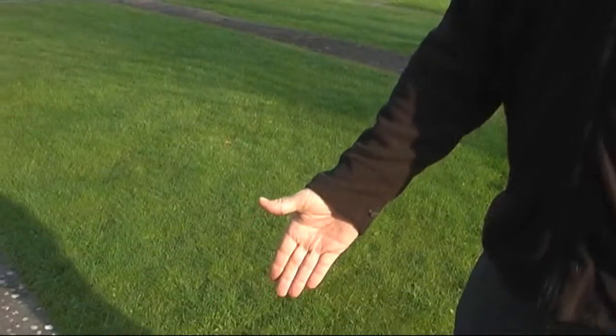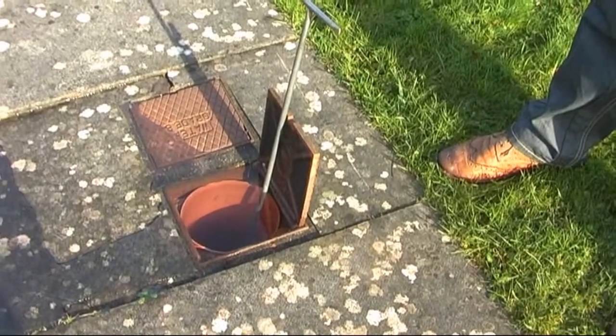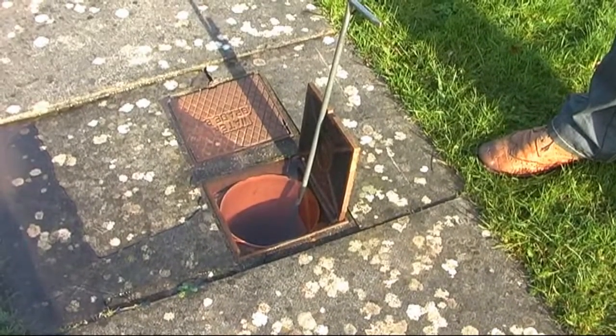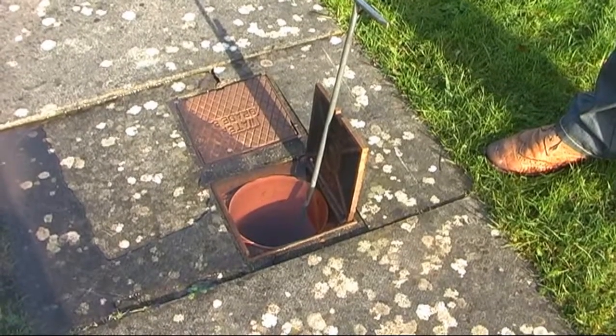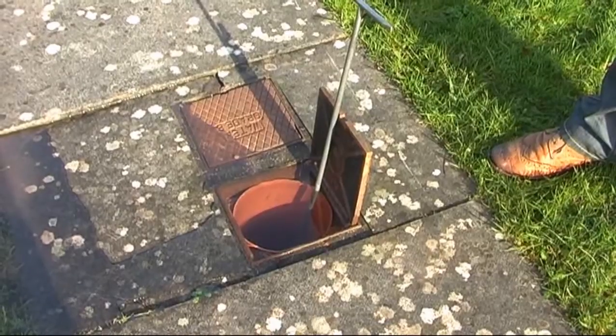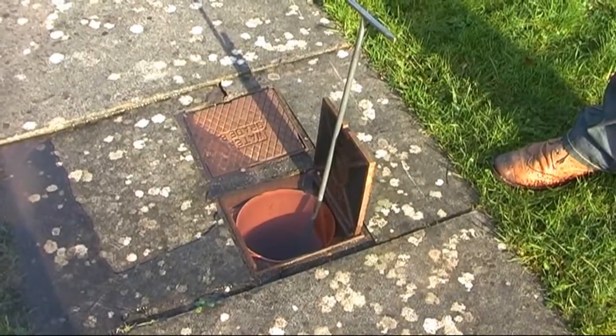This is a typical leak which we've just been using to do a test on PVC, which you'll see on one of the correlations. It's a very small leak, just a bit of a dribble, but the correlator found it. It's one that we struggle to find with any other correlator, but the Touch in filter optimisation mode actually finds the leak, which we're very pleased about.